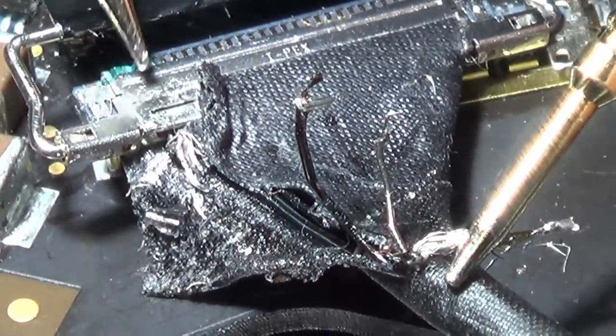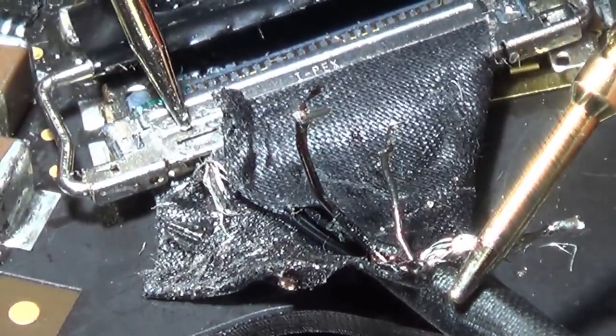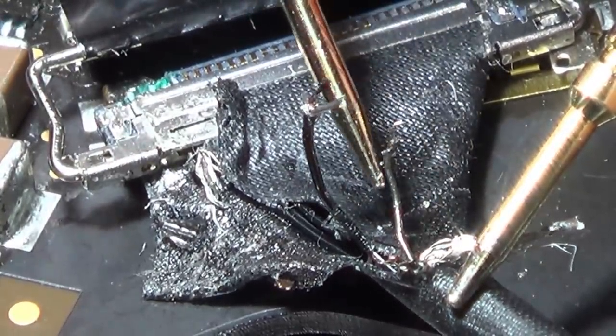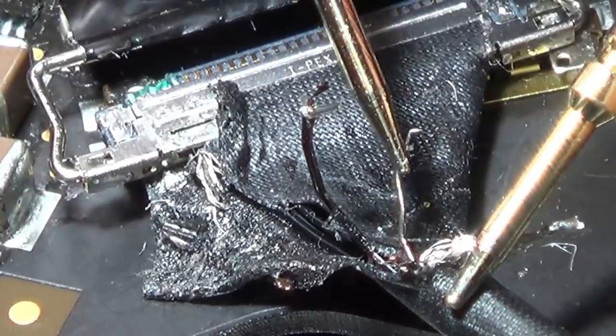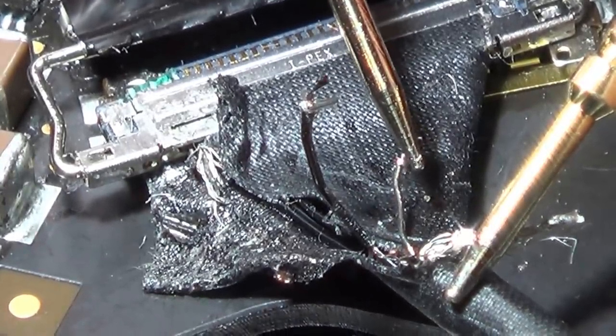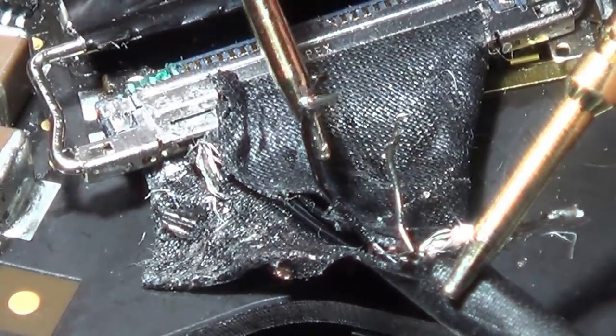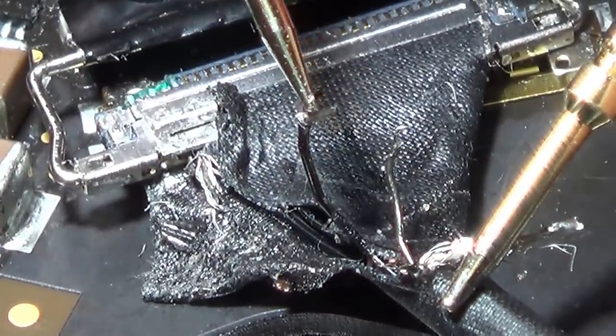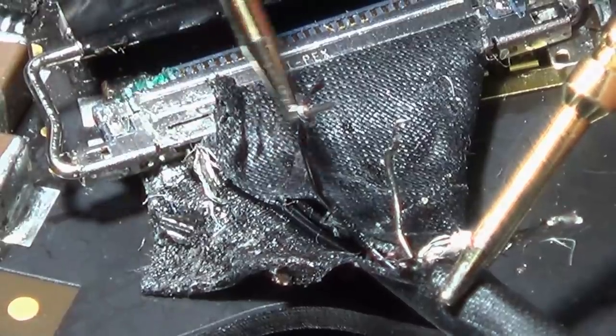When I go onto here, you can hear it shorting. But look, when I go onto here, not that one, this one. I've just tinned up the end of that there, it's not shorting. So now I also need to trim back this one here, and then I need to join the middle two together and run them to a wire to the inductor.